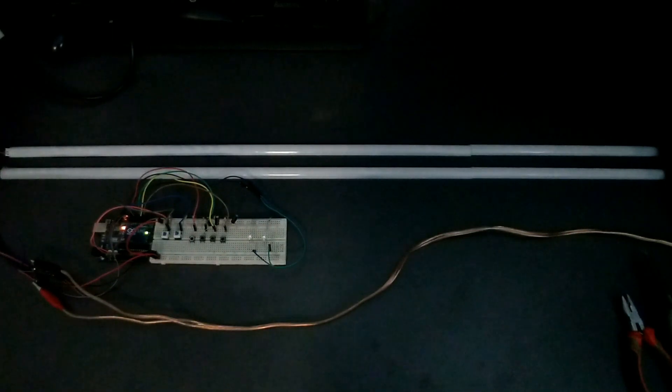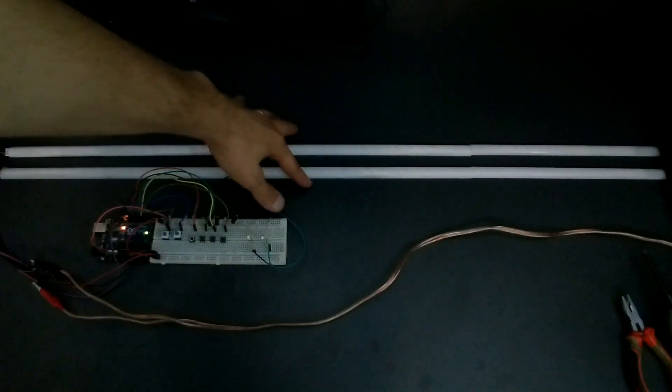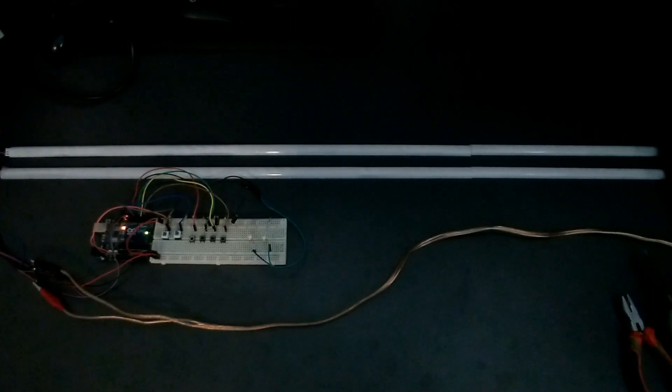In this clip I've used WS2812 with 60 LEDs per meter, but to increase the power and animation smoothness you can use WS2812 with 144 LEDs per meter — that's almost triple the output power. Here we have two LED strips with 54 LEDs, but you can use as many as you want. Just remember to use an even number of LEDs, and before you cut the strips, test and make sure all the animations are working correctly.